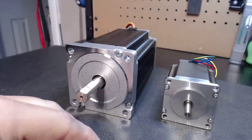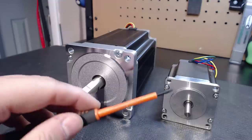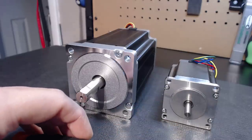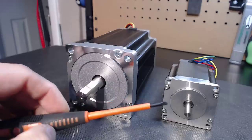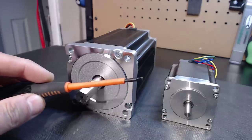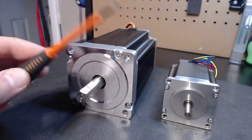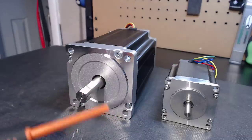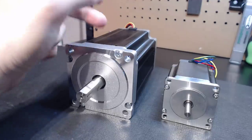When I make a recommendation for these motors, I always ask first: what's your application? The 300-ounce application will always go first, then typically table size — and I've yet to have a guy say the motor just isn't moving his table. Whether he designed it or bought it as a system, it's really a question of application use, feed rates, and material. I've never had a client say their table is cutting too slow, unless they're running a ridiculously low power supply. They're usually looking for more cutting power, and that stems from a combination of not just motor selection, but the spindle, the feed rate, and the end mill.